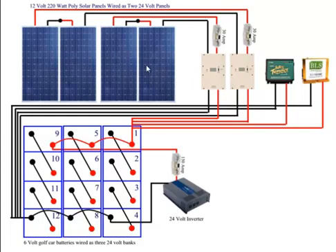In addition to the solar panels and the charge controllers charging the batteries, I also have these two items over here on the side. This is a battery tender. The reason why I have the battery tender wired into the batteries is because 99% of the time I don't have the solar panels charging the batteries, and I want to keep these batteries charged up. This is a 24-volt battery tender, plugged into my regular AC power in the house. It maintains my batteries at full charge — floats them so they don't overcharge and keeps them from getting discharged.